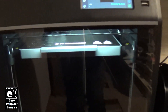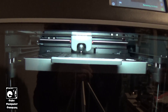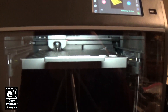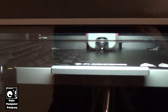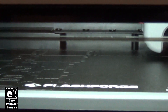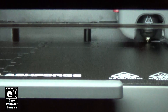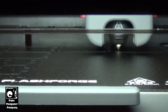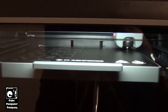Okay, so this has been going on for a few minutes now, and you can see that we have perfect adhesion this time around. We've gotten in much further so far, and so far, so good. So anyway, that is how you can clean the build plate on the FlashForge Adventure 5M Pro, as well as other 3D printers with this style of build plate.